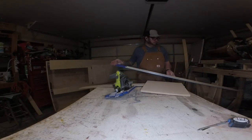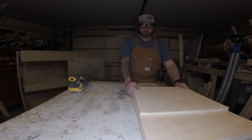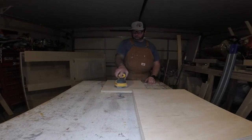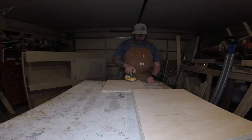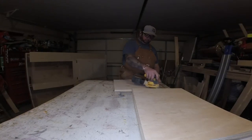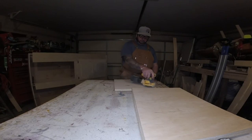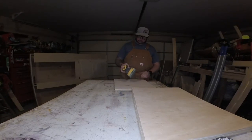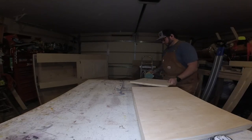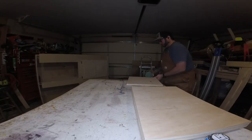You can build this toy box to any dimension you want. This particular one is 15 and three-quarter inches tall to the top — the top is three-quarter inch, so I cut my sides 15 inches tall. The sides are also 15 inches front to back, and the front and back panels sandwiched between the sides are cut to 22 inches. One sheet was cut to 15 and a half inches because the top will have a half-inch overhang on the front. Here we're doing a little pre-sanding to get everything ready for later.